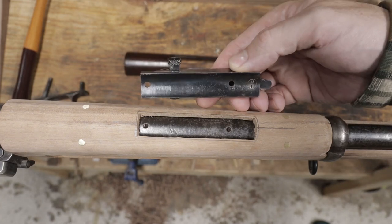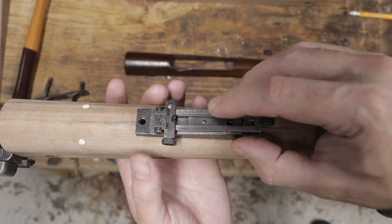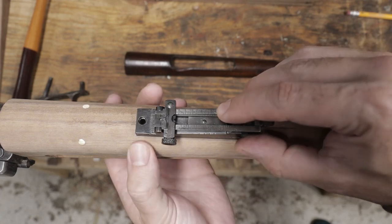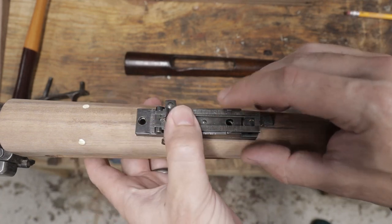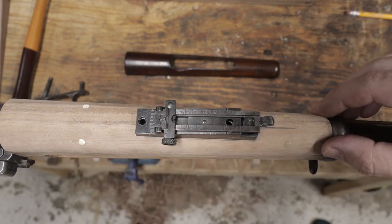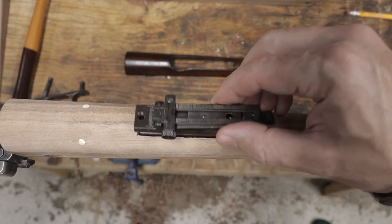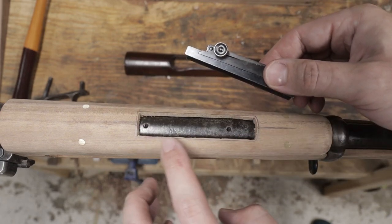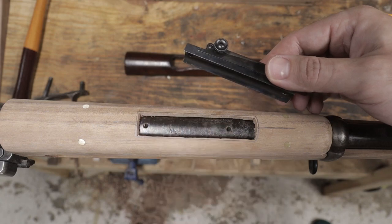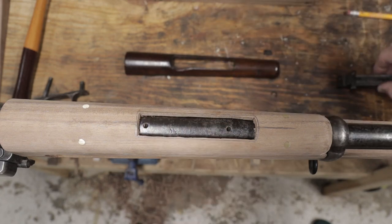There's the cut, aligning the holes to the rear sight. I didn't venture outside of the sight's footprint at all. But to cut the remaining material, I really don't have any better way of aligning the handguard and the barrel to be able to check the fit as I go, so I'll have to cut it out with these together like this, and I'll make sure that I'm very careful with the chisels.